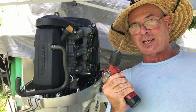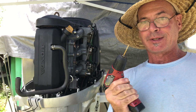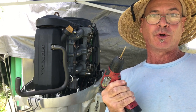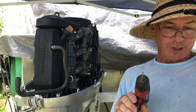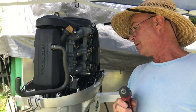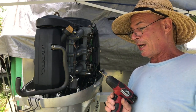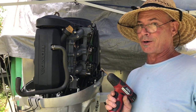After decades, I finally invested in a drill bit sharpener, after throwing drill bits away and buying new ones. Because drilling through stainless — good stainless — it's pretty hard on drill bits. And if you bear down on it with a dull one, you just make the metal harder.